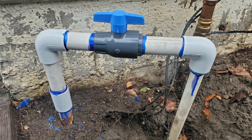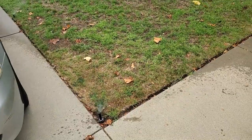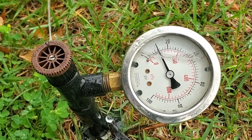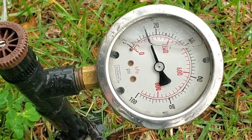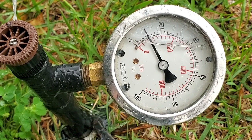To avoid any restrictions in the water flow, I built a one-inch shutoff assembly and piping. Now that this was in place I turned on that front lawn line and voila — the sprinklers popped up! I checked the water pressure and it was now 15 psi, so that was a big improvement. It's still supposed to be a minimum of twice that much at 30 psi, but hey!